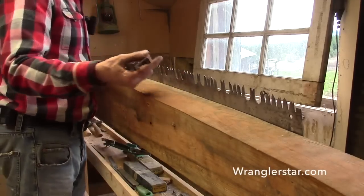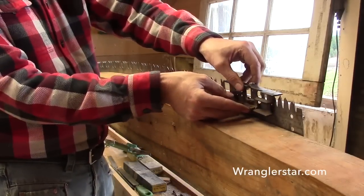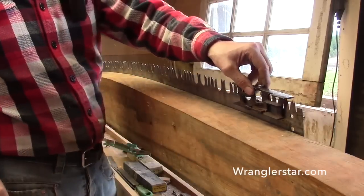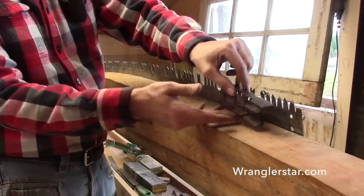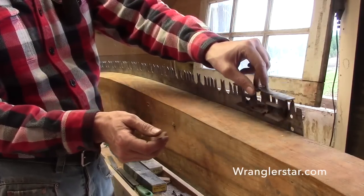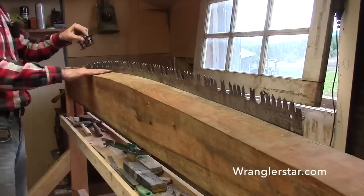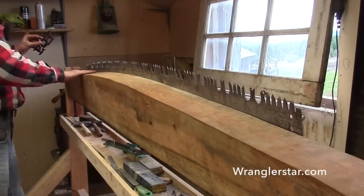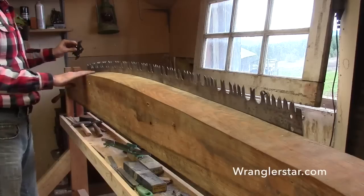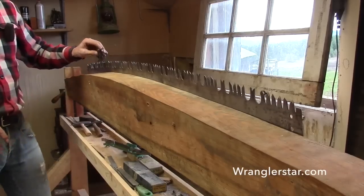With the pins in their new locations, you can see why - this raker gauge, the pin gauge on this side, needs to clear. We can't have the saw sitting so deep that it bumps into the vise. You can see it'll clear all the way around, and you can see why the vise has the shape it does - it follows that contour of the saw.